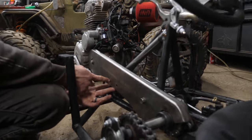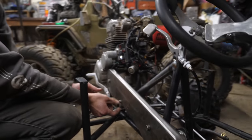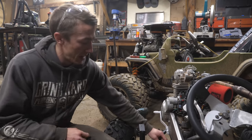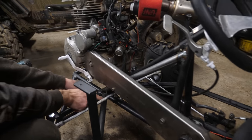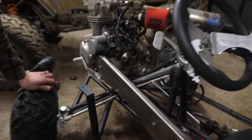This tensioner, after rallying it, we did get some slack, so I was able to make a smaller, thinner tensioner on another pivot, same screw there. And then for rigidity, because this was flexing when you'd be under load, I just put this little piece here that bolts to the frame, so now it's nice and sturdy. You can pick it up by that if you wanted.